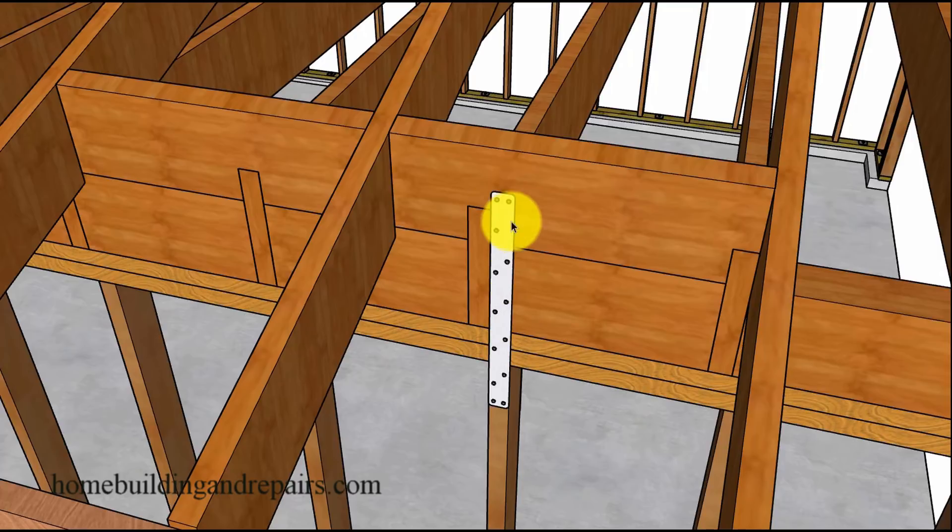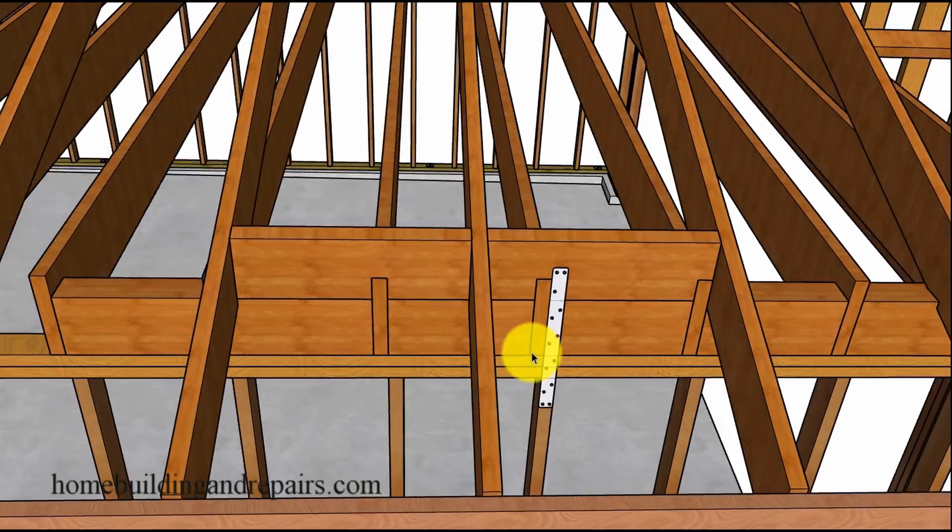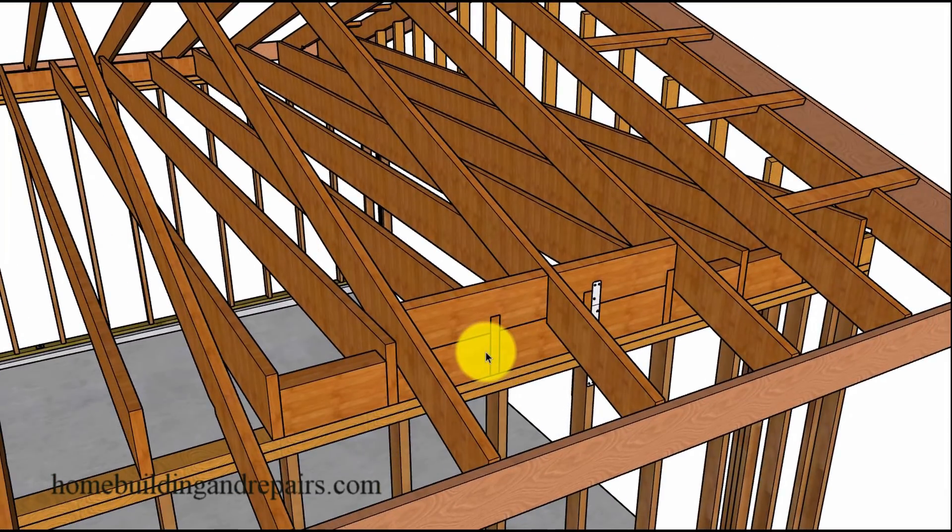If you can keep the straps close to the rafters that tie to the ceiling joists, you'll be even better off. A strap connecting the block, the roof rafter block, and the ceiling joist — or the block supporting the rafters and the framing plates — will give you a nice connection. As long as they are not spaced any further apart than 48 inches on center — they can be 16, 32, or 48 inches on center, but not 50 inches on center.